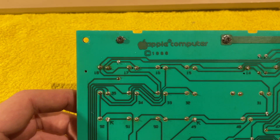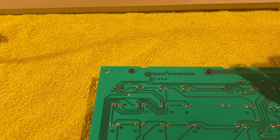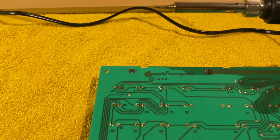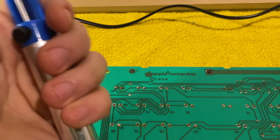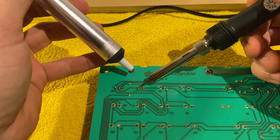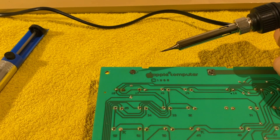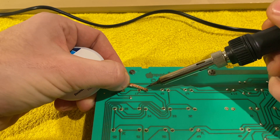I've marked the faulty keys with a small black dot — these two appear to have no resistance and these two do, so I'm going to desolder them and see if I can make them work. For basic desoldering there are two techniques. Here's the soldering iron, already heated to 350 degrees Celsius — about 700 degrees Fahrenheit. Using the desoldering pump: activate the suction, make the solder liquid, and pump it away. As you can see, it worked — the solder is gone.